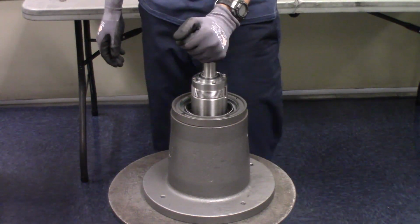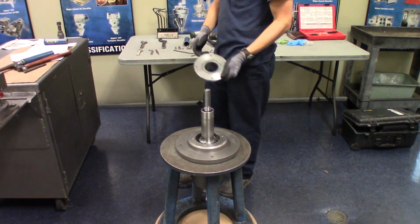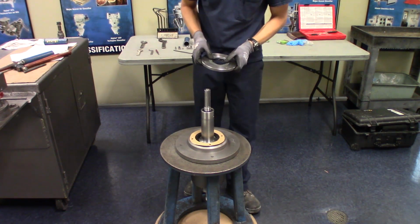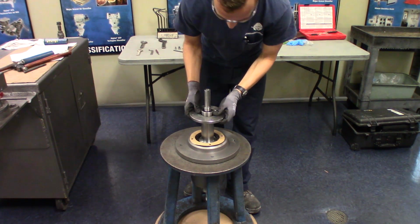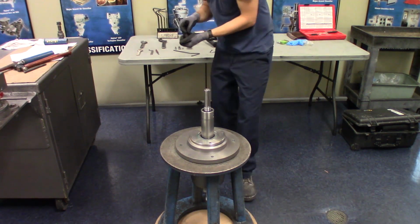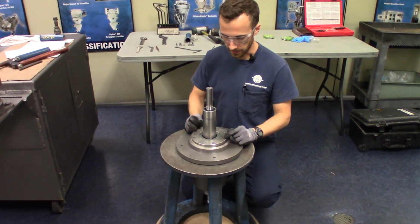For the next few steps, we'll flip over the bearing housing and work from the other side to get the other end covers on. Okay, first we'll go ahead with this end cover on this face of the bearing assembly. And again, we have a gasket, so put that in place. The shaft seal goes over the shaft. And here we have the same kind of bolts.